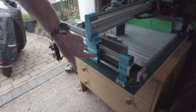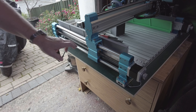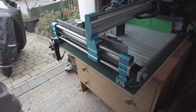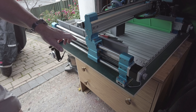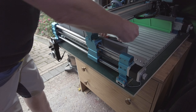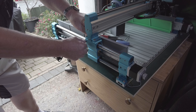That is the side cover off. That exposes the anti-backlash — the big part is here and the other part is here. You can see the dirt accumulating. I used the rotary the other day just to turn a ball-type thing for a project. I used a wet lubricant and you can see there's very little dust, so it's done the job really well.